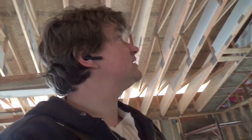Same thing. Once more, I don't know. Certainly if I was down in the basement, I wouldn't be using those things at all. There's no way that the pressure can get behind the rock wool and push. But this is all open, and will be for a long time. So I have put up the board and batten, as you can see, so that when that wind pressure gets up on top and pushes down on that massive span of surface area, it just doesn't drop out like Minecraft.